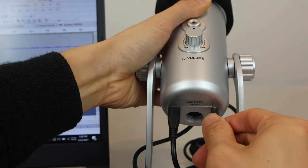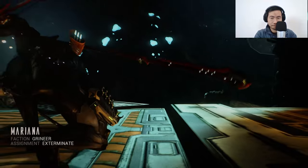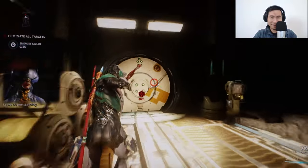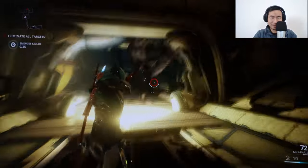You can optionally plug a set of headphones into the output port on the bottom of the mic to use as studio monitors, so you can hear what your mic's input sounds like with zero latency. However, I couldn't figure out a way to hear both the mic input and my computer's audio overlaid with one another. Once you start playing other audio, the mic feed cuts out. So you can't actually hear yourself while you're recording or streaming if you have another audio stream going on, like audio from gameplay. That makes this feature a little less useful in my opinion.